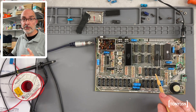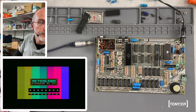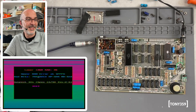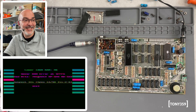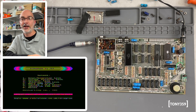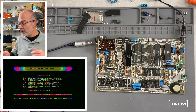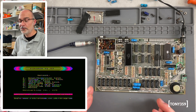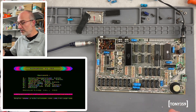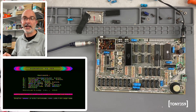The RAM IC is replaced — let's power on and see if it works. We now have IC19 showing as faulty, so I'm wondering whether IC20 was actually faulty or if both 19 and 20 are faulty, with 20 being first on the line. The thing is I can't easily socket these ICs because with a socket the keyboard doesn't fit anymore, so they have to be soldered to the PCB. It's not too bad to desolder them, but it's not as easy as on a Commodore 64.